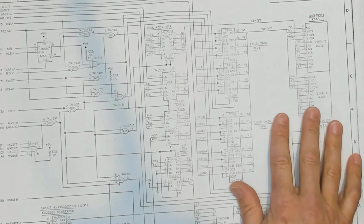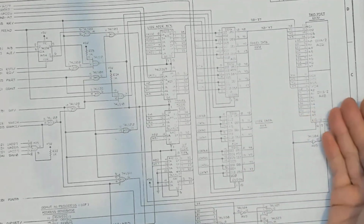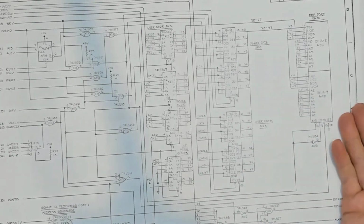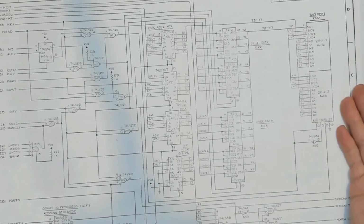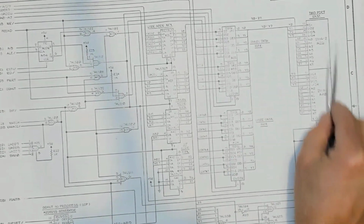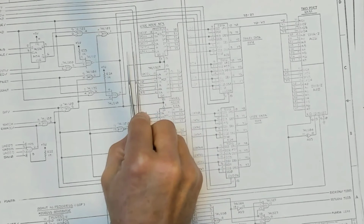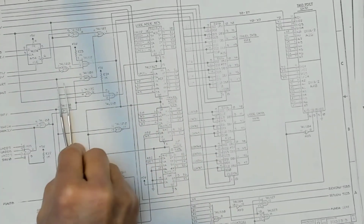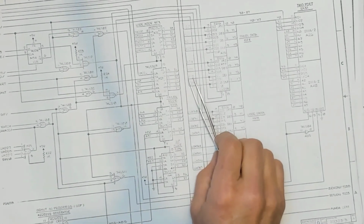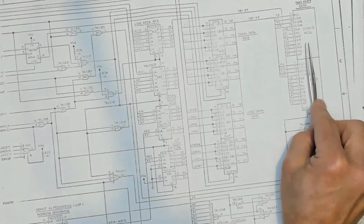So of course, allowing memory to be mapped onto the system under test is a fantastic thing. That was one of the big powers of this microscope. The user has control, you can access that memory as well as the system under test, so it allows the user to come in through their programming and change that. You can change in real time whatever data or program resides in that memory block. Here to the left of the memory block, so this is the RAM here, we have some multiplexers. And then to the left of the multiplexers, all of the other logic out here and the page that feeds this all determines which of these three entities, either the device under test or the onboard 8085 or the special application, which of those three entities are accessing this RAM.